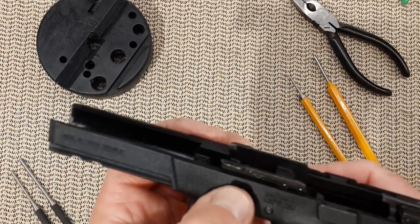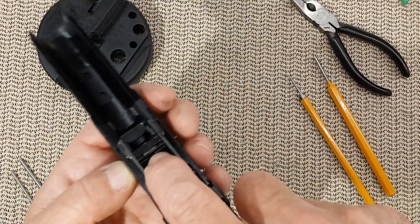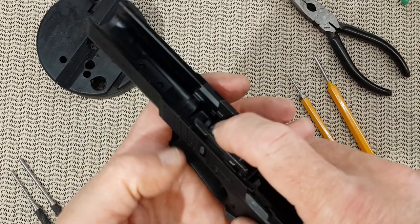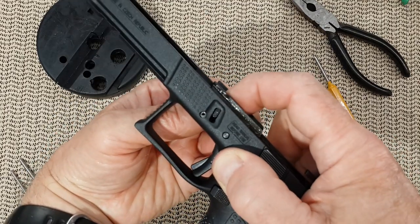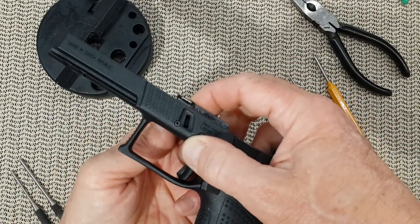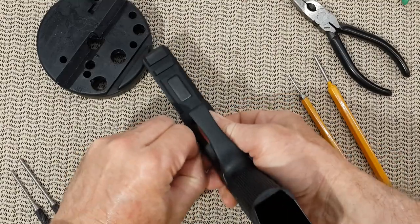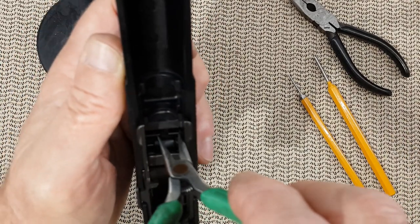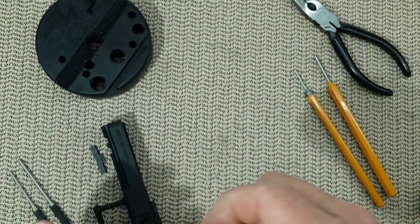To start disassembling the lower frame, you need to remove what we call the disassembly plate. There is a spring underneath — watch out, it is under high pressure. I already lost it once and got lucky to find everything. You don't need any tool, just push on it to compress the spring, push on the side, and slide it gently. When you push on it, it creates pressure on the spring. Go to the other side and pull — it will come out. If you are not confident, you can reverse it and let the spring and block come out onto the table. Here are the springs and the retainer that we are going to put aside.